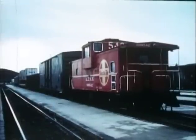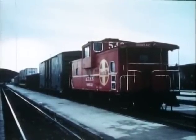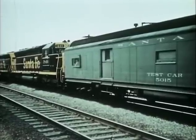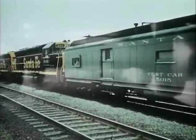The tests were run with a six-car consist, powered with two EMD SD45 locomotives. Accelerometers were to measure lateral acceleration on each car, along with displacement transducers to measure rotation of truck. Television cameras were mounted beneath the cars for monitoring the truck and wheel movements during high-speed runs. Controls and recording equipment were located in a special test car. The results were significant and illuminating.